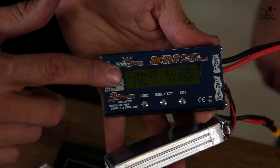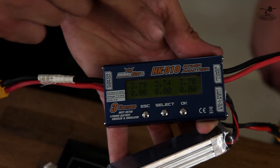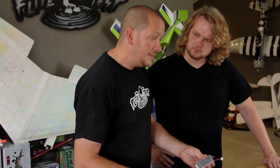Why is that so important? As you can see here, there's almost nine-tenths of a volt between the highest and lowest cell. When this tries to get up to the full charge voltage — since it's a 3S, that'd be 12.6V — it's going to overcharge two of the cells trying to bring the last cell up. If you're only charging off the main plug and not the balance connector, the charger can't correct for that, and that's when you're most likely to have fires and serious problems.